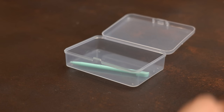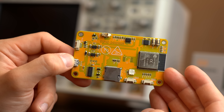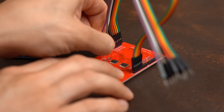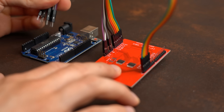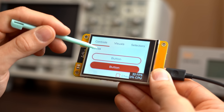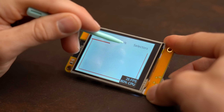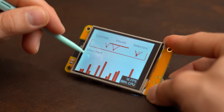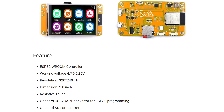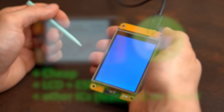Back to electrical stuff: this board is not only an LCD but also a complete ESP32 microcontroller development board on the back, for only €10. It intrigued me because creating a graphical user interface with a microcontroller and touch screen can be quite cumbersome. But here you simply give it power and immediately see what it can do, as it comes preloaded with a demo sketch. Mine has a resistive touch screen so it is not super responsive, but it is good enough for many applications. With Arduino and Home Assistant libraries available and decent documentation, I give it a thumbs up.